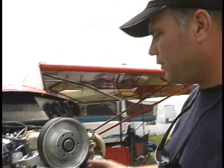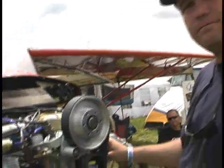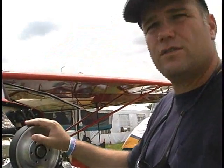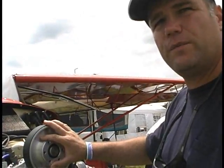You've got a high performance race engine here that's capable of doing 6,000 RPM, but we only turn maximum power at 4,260 RPM. And you've got a belt reduction drive on it. What type of ratios are we using? We can use anything from 1.6 to 2.1 reduction, depending on what size prop and what kind of flying you require. We can customize that top pulley to make that reduction for you.